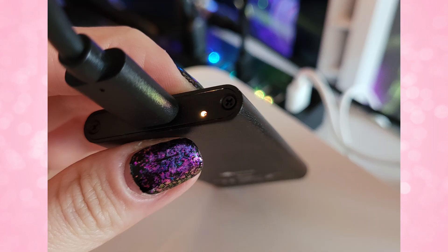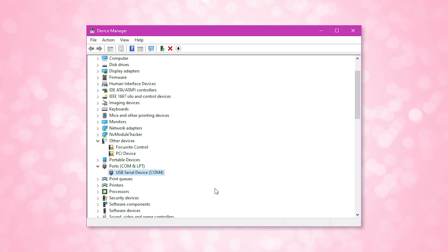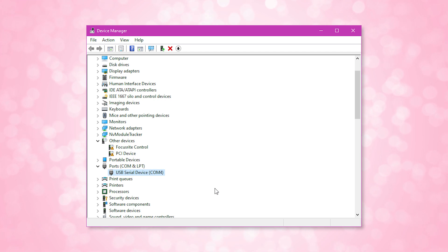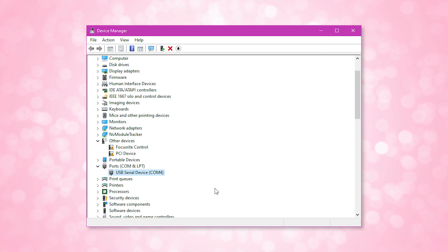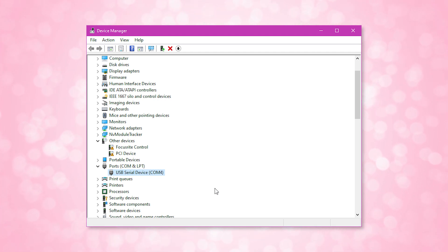So don't judge me too hard, my Linux friends — I still have a Linux box. It's my laptop, an XPS 13, and it's great. On my Windows 10 box, I just plugged the Nova into my USB port and it enumerates as USB serial device COM4 under ports. Whenever I pull up device manager, you can see it there. If you unplug it, that one will become a shaded gray color, and that's basically how I can tell if it's COM4 or not. It comes with a little device called a test circuit that can be plugged into the IDC connector, which contains five different signal pins.